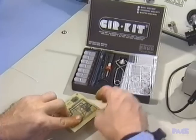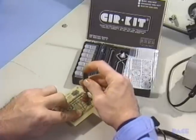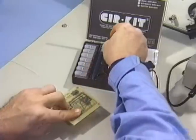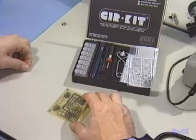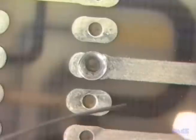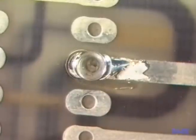The repaired area is positioned on the support base. We'll use the cone-shaped tip of the eyelet setting tool to swage it down good and tight. The eyelet is funnel-set so that we'll get a reliable fillet between the land and the body of the eyelet. Now we will hand solder the eyelet. This gives us an acceptable fillet under the funnel set. Clean it up and we're as good as new.